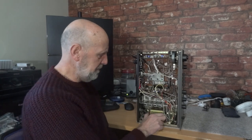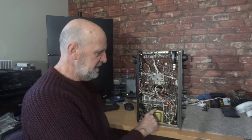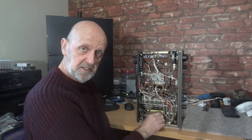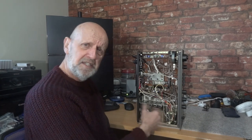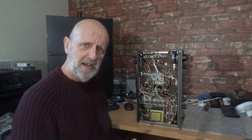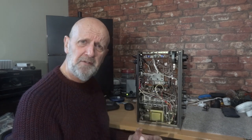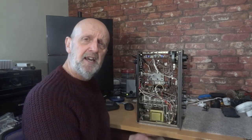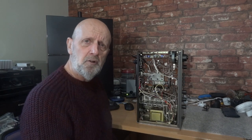I'm going to show you that video in a minute, but basically what's happening is there's a gap between the outer case and the transformer core. At 50 Hz or 60 Hz depending where you are, it resonates and buzzes, and it can be horrible — you can overpower some low tracks if you've got music that's very quiet. It can amplify on a wooden bench as well.